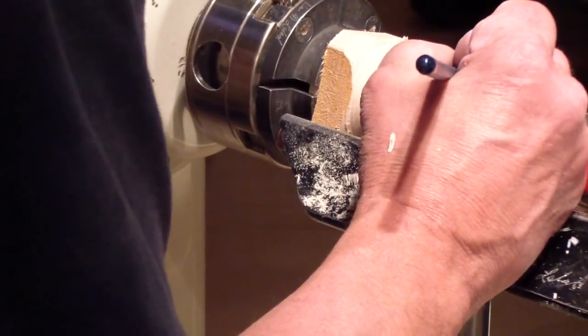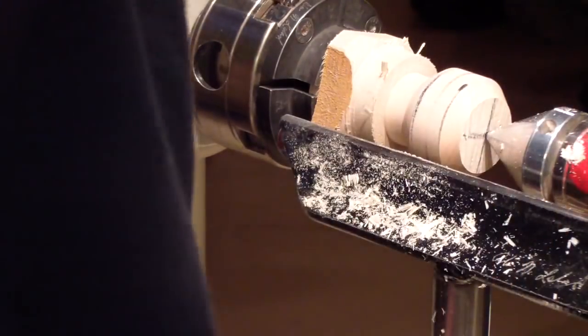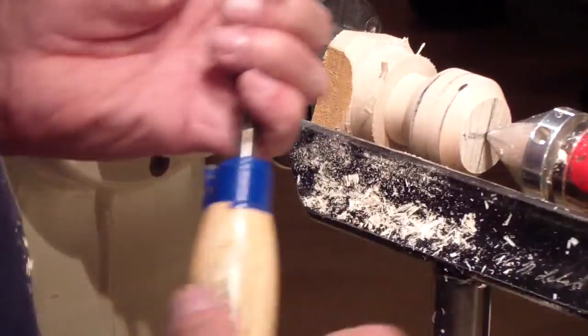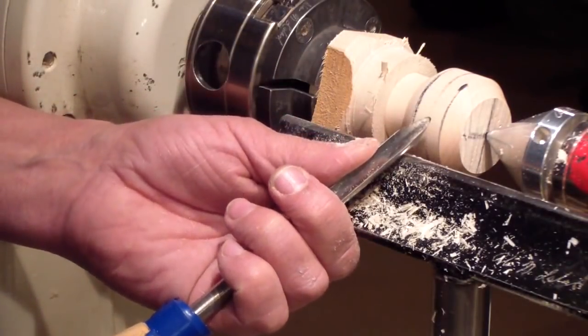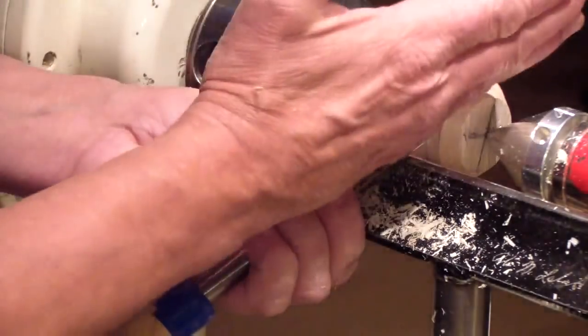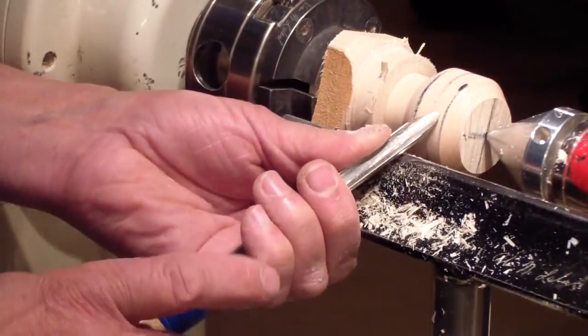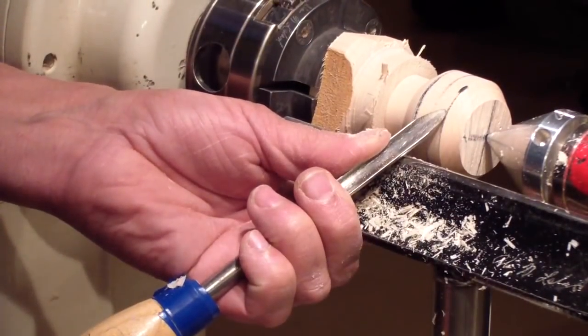And what I'm going to do is knock this edge off right here. It's going to knock about 1/8 of an inch off. And I'm just going to start working my way around. You'll notice I'm pointing the tool up in the direction of cut with my body open. The flute's going to be at about 2 o'clock or 45 degrees, plus or minus a little bit. I'm going to be cutting dead center